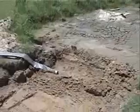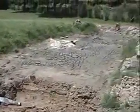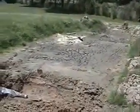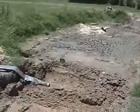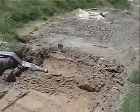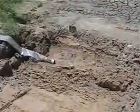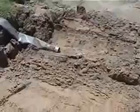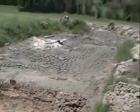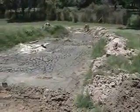We've dug a small spoils area here. It actually holds about 10,000 gallons. And the idea here is that we're going to discharge the material into here. There'll be quite a bit of water along with it. And the sediment is going to settle out, and the water will carry out the end of our little dam there and gradually feed back into the pond. So we're recovering all of our pond water, yet we're getting all of our sediment to drop out right here.